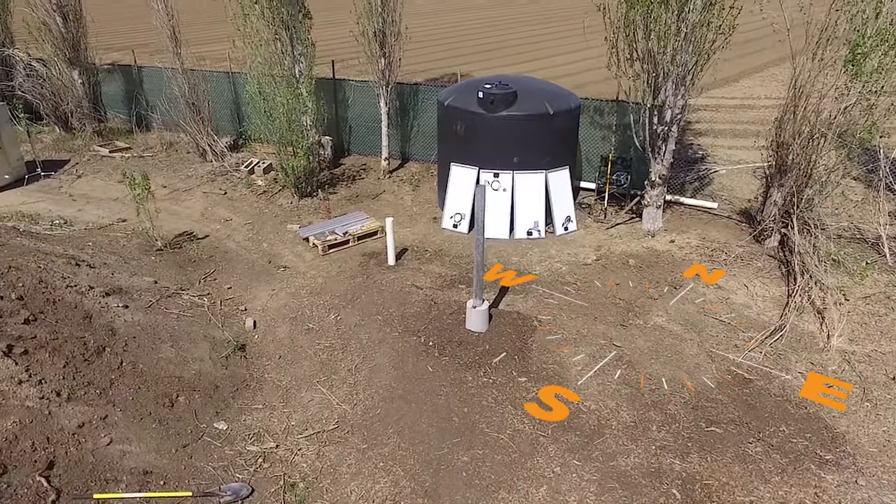We have our controller mounted onto our pole and I went ahead and pulled off the door — it's convenient to rest the door on top while we do all the wiring. If you have a two-panel or four-panel RPS system — that's the RPS 200, RPS 400, and RPS 400V — we're going to connect all the panels in series and then using our solar extension wire, connect the two ends down to our controller. If you have an RPS 800 or 800V, we don't want to hook all eight panels in series. We want to hook four in series in one chain, then four in series in another chain. Inside your pump box are Y connectors that allow us to hook the positive wires together on one side and negative wires on the other, putting the two sets of four panels in parallel.